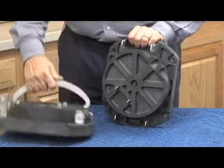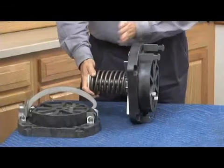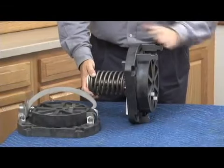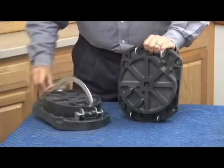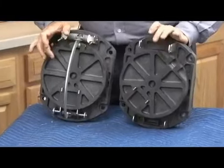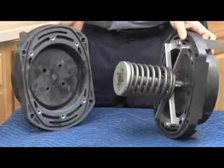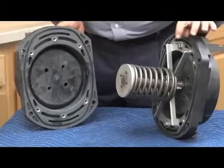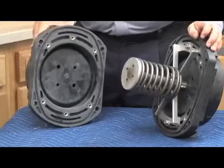So the second check is a pivot style check. But the first check is a standard poppet style check where the disc comes out, compresses the spring as it goes in. So the parts are semi-similar. Obviously the spring loads are dramatically different. But you'll see they use some of the same parts from the double check assembly than they do on the first and second check. The spring mechanism just bolts on to the seat, like you can see here, and sits